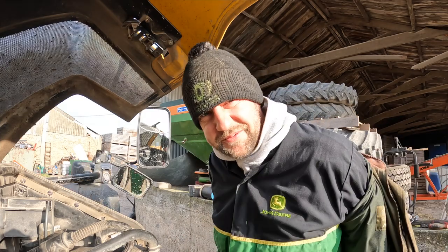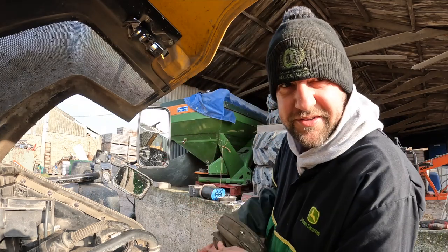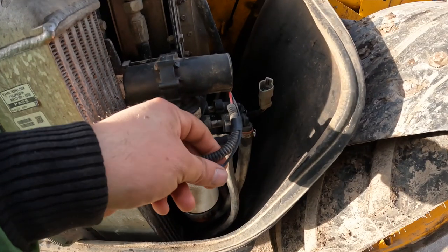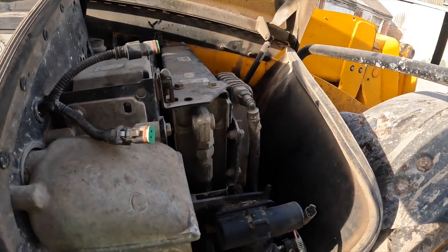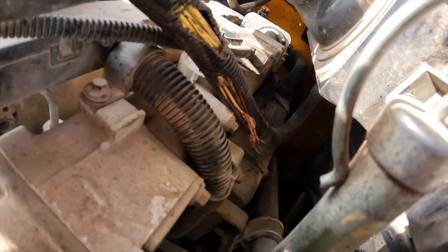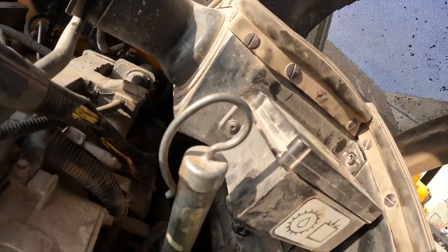JCB problem sorted. The fan had been catching on the wiring — the clips had come undone somehow. Grumpy Granddad fixed all that and we're away. We'd also had a problem with the earth on the electric fuel pump — Dad just hardwired an earth into it, we thought we'd sussed it, and then all the electrics failed on me the other day. You can see it there, all been running and chafing on the fan. Two bolts in there, one underneath which I'm struggling to get to.